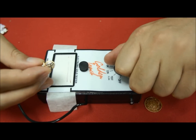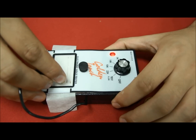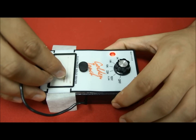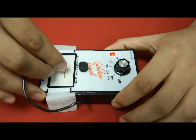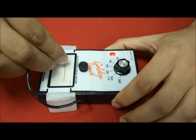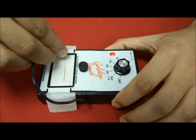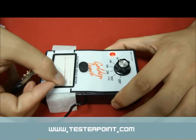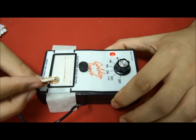Let's go to the lower level — 14 carat. I maintain contact for 3-4 seconds and then drag. You can see that the beginning of the marking is much sharper, darker, more concentrated, and the line is completely different. It's a full line of marking and a very strong marking. So at the 14 carat setting, this item is giving us a full proper line, and the item has no problem sustaining the marking. At 22 carat the marking was too weak, at 18 it was still very weak, but at 14 it gives a full marking. So this item is 14 carat, at least.